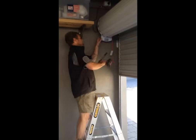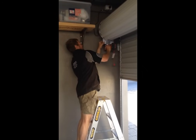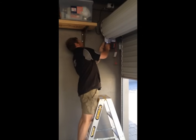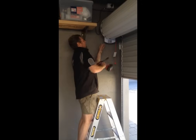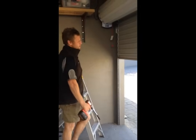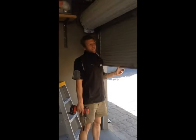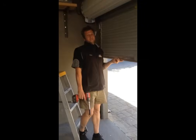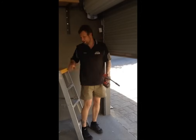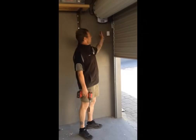So now we can also re-secure the motor. Now the motor is nice and secure. It's looking like the door is going to hold its own weight halfway, which is just going to help out the longevity of the motor. Now after doing this, we'll need to reset the limits on the motor as the settings for the motor have changed.